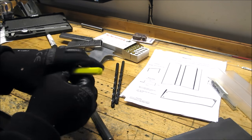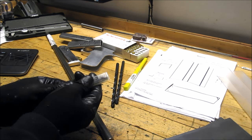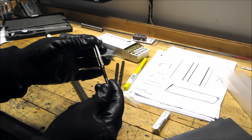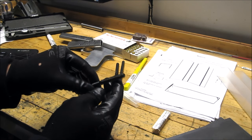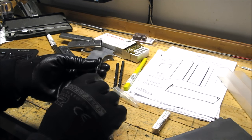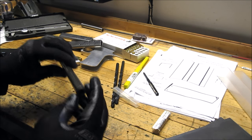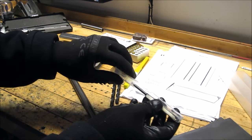And here's something that I used reaming valve guides on my aircraft engine a number of years ago. Little adjustable reamer. You can just undo this nut here and tighten this one, and you can move these out a thou at a time. In fact, it's recommended that you only do very small cuts so you don't shatter those blades, and then just hand crank it through with a tap handle, and I will bring this up to exactly where I want to go at 353 thousandths. So a lot of numbers, a little bit of a math lesson there, and we'll carry on from there.